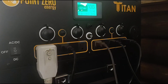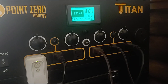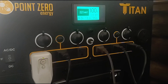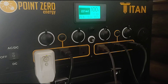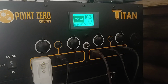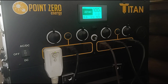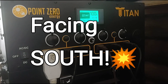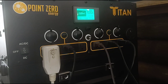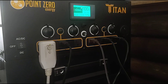Overall, this system gets five thumbs up. We can't think of a single problem we've had in about a year and a half. Feel free to drop any questions or comments — this was me and my wife's first time dealing with a solar system and we installed everything ourselves from the ground up. The Titan 2,000-watt kit comes with 20 100-watt solar panels. We chose a ground support instead of roof mounting because we live in an older trailer. In Florida, aim for a 30-degree angle facing south to maximize solar energy all day.